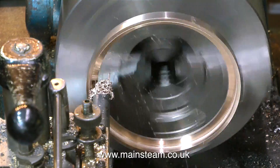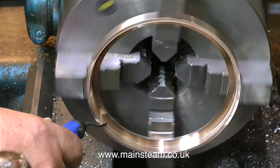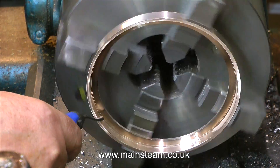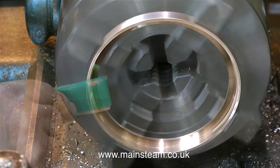If you try and machine it too fast, particularly if the tool is blunt, you get a bruised finish on the metal. I've just machined this inner shape to fit the boiler — that by the way was a deburring tool; I was taking the sharp edge off with it.